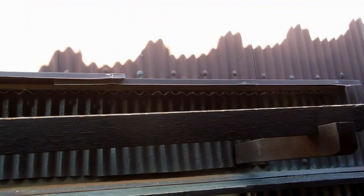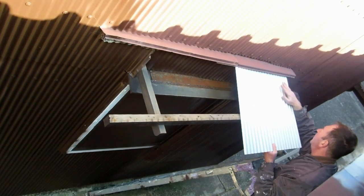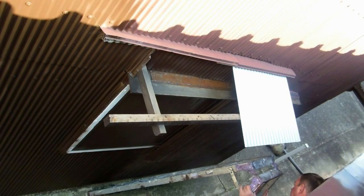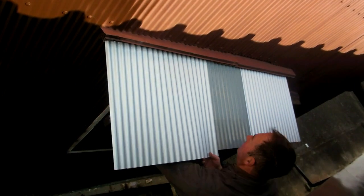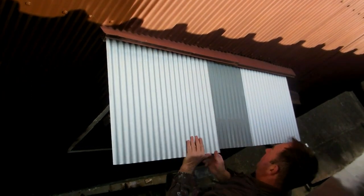Now the plan: we can't just pull out that remaining bit because it's got nails through it - it's really solid in there, and so's the wood above it. So that means if you put a new sheet in between that corrugate and that wood, it won't move. Trying to fit the new sheet in between the piece of corrugate that's left in there and the wood above it - and it fitted really nicely. Doing them all first before hammering a nail, because when you're working with structure that isn't square, it's better to make sure it all fits first. Learned that by trial and error.